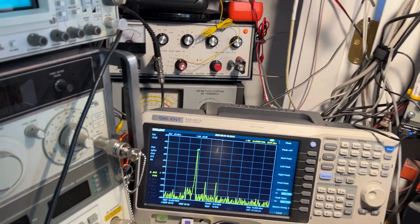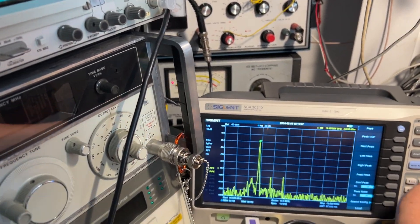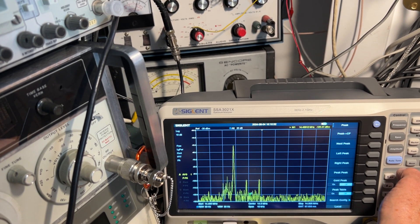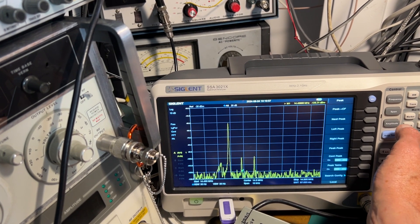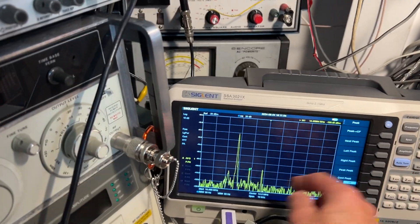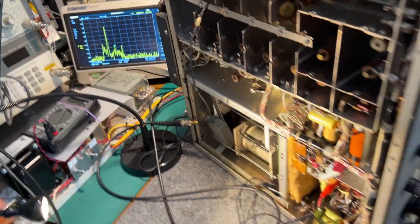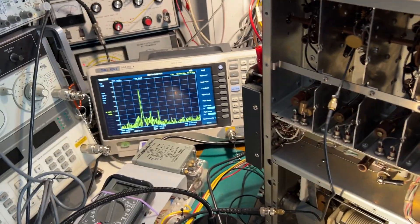You can see there are two ancillary peaks there. Running the peak along there, you'll see this is one kilohertz away from the carrier — yeah, about one kilohertz away. The second peak will be two kilohertz away because there's a one kilohertz tone being fed in. Basically I think the functionality is picking up the voice on top of the tone.